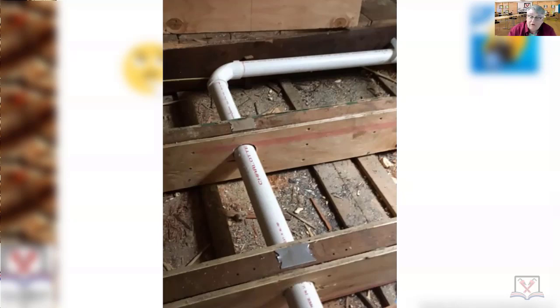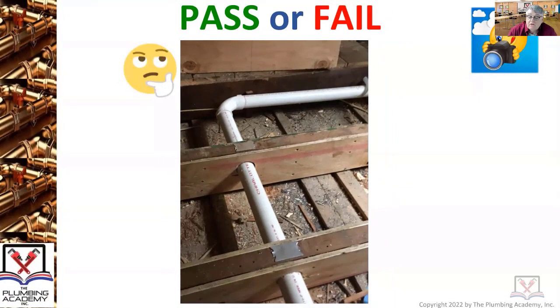This is an excellent example of a plumber who's a craftsman and worked with the contractors. I was always taught as an apprentice — this is what you do. I wasn't going to wait for the contractor or the carpenter; maybe I said something to them, but I would just do it on my own. A plumbing inspector can fail a job if they recognize that you made the structural members non-compliant because of the hole you drilled through them. So again, gusseting — very important.